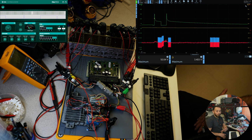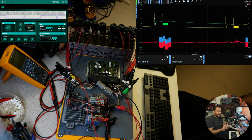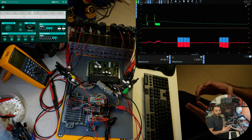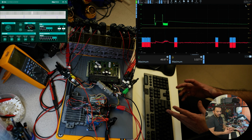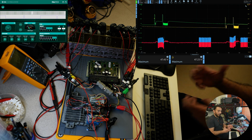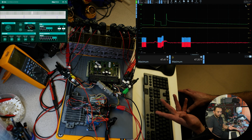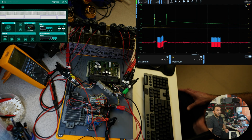So I don't want to run it for too long, because what if it shorts in here, the capacitor starts leaking and explodes in my hands? No. So I always perform a very short test just to make sure that the pre-driver, which is a very expensive part that I don't usually replace unless it's bad, because it increases the price exponentially, is working. I need to test that to give the customer a good recommendation, and it's working good. But it's not very common for that to fail. It's only a few cases so far, maybe 12 out of probably 150 or so FICMs that I have repaired.